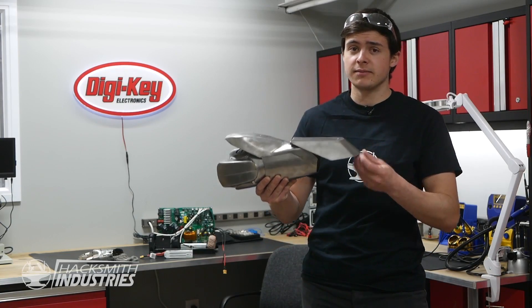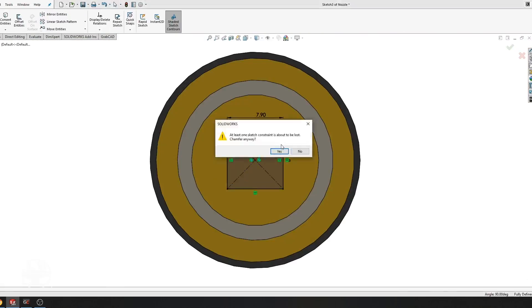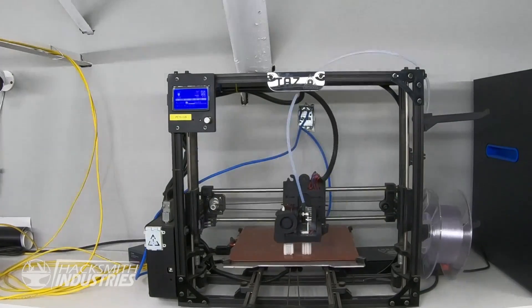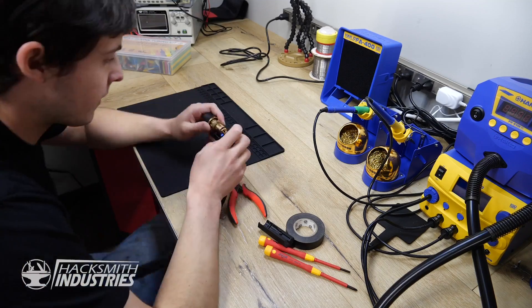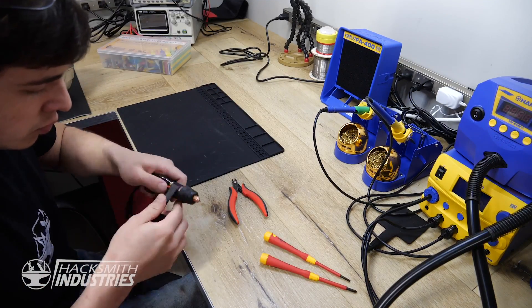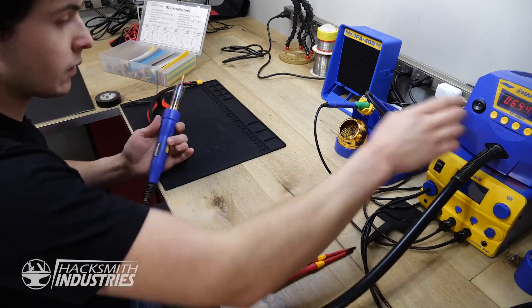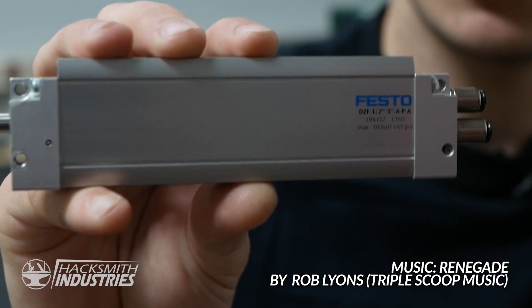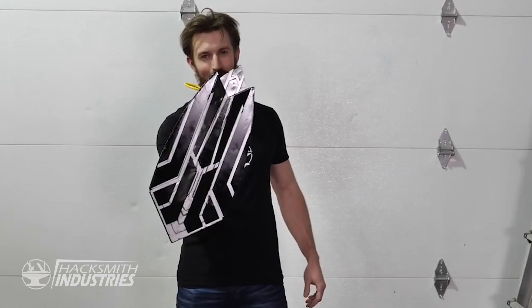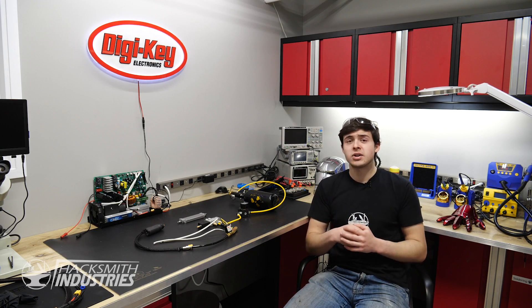We're going to have to figure out how to fit the nozzle into the gauntlet — let's start by taking it apart. Here's the disassembled plasma nozzle. I'm going to model this in SOLIDWORKS and 3D print a nice little case and mount it into our plasma gauntlet. The new body of the nozzle seems quite sturdy. Next, we have to figure out how to make it extend and retract, and we're going to use a low-profile pneumatic cylinder — the same one we used in the Wakandan shield two years back. It's time to mount it onto the gauntlet, throw the plasma cutter into our backpack, and get to testing.